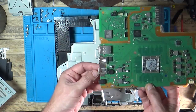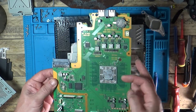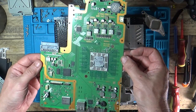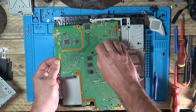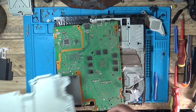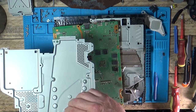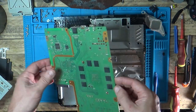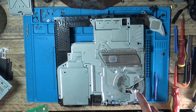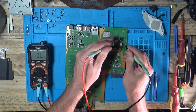The board's looking okay. We have got some rust around our USB ports. Thermal paste is still soft in the middle. Right, so where do we start checking this out? I'm just going to get these thermal pads off so I don't lose them while I'm cleaning the board. I'm going to give everything a good dust down, then we'll see what's what. Unscrew this fan and get it out. Let's start poking around for shorts.